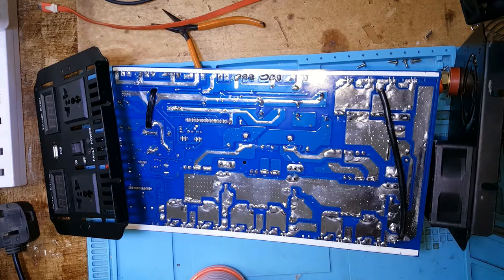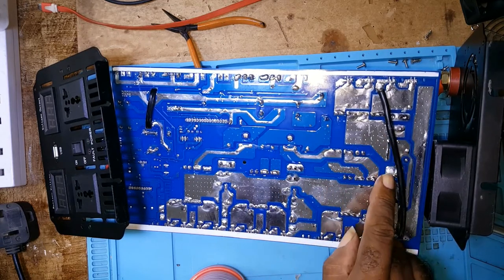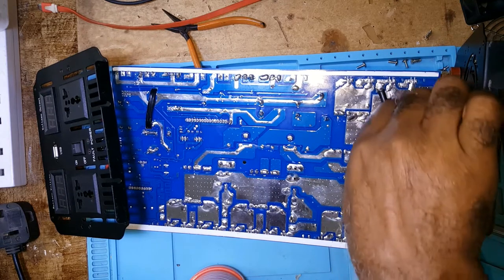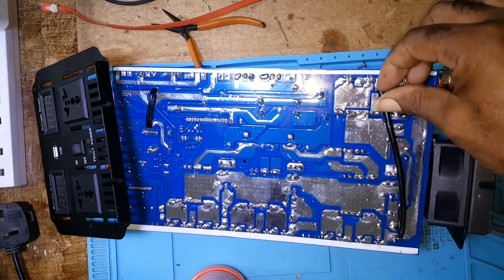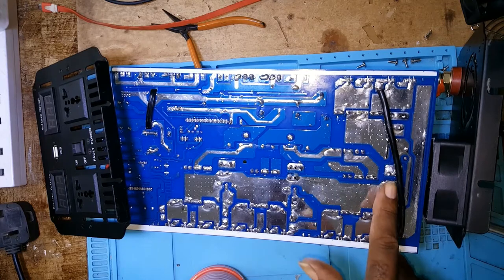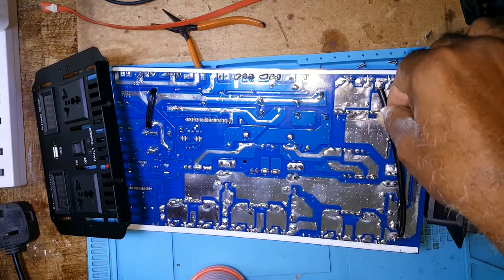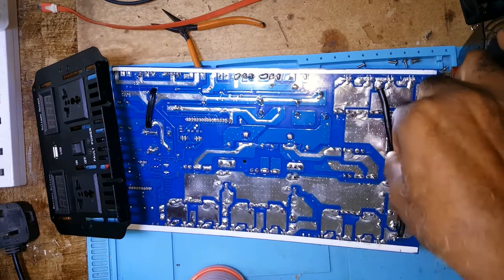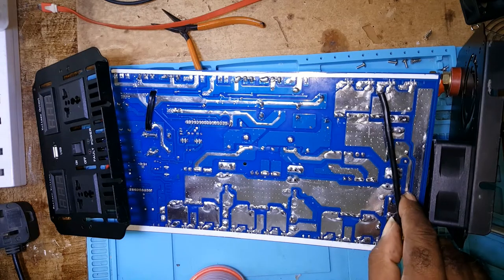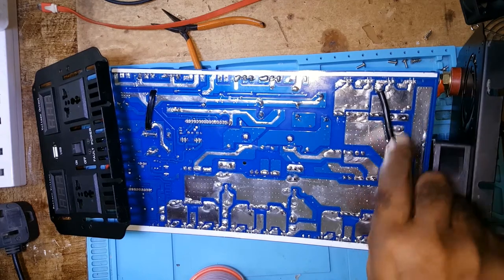The other thing is this wire. They don't have anything underneath it, and it's resting on these units or these welds. If anything gets hot, and that's not silicone, that's a hard top. I don't know what wire it is. If it gets hot, it could start melting. So I'll be putting something underneath here to protect it, or just try to raise it a bit. I try to see if I could see what gauge it is, maybe 10. Yeah, 10 gauge.